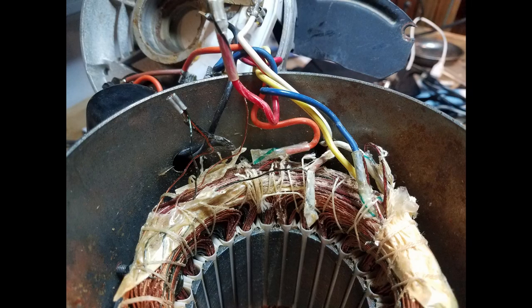Those winding ends will be closest to the area where the insulated colored wire goes to the windings. Here I've indicated where you're going to cut. That area is wrapped in string, then covered by paper, and then they put a clear varnish over it — you just need to cut that open with a blade and pull up on the wires until you expose all the winding ends. Now here you see the winding ends. All the winding ends towards the right are run windings. Towards the left you'll see the ends of the start windings — the smaller copper colored wires and the dark green wires. I'll call them A and B. We don't know which start winding we need to swap, so we're going to try one first. If it works, we'll wrap it up; if not, we'll put it back and try the other one.